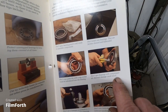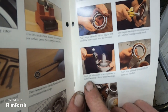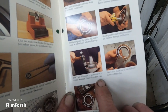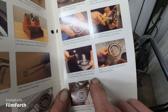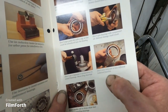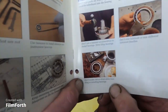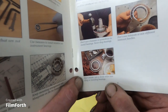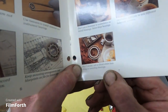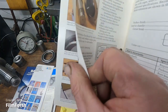Don't spin the bearing with compressed air — this is very important, and everybody does it because they don't know better. Don't use a hammer or screwdriver to install bearings. Never drop them. Don't over-lubricate or mix different lubricant families — that's critical. Follow the instructions for how much lubricant to put in the bearing and where to put it.